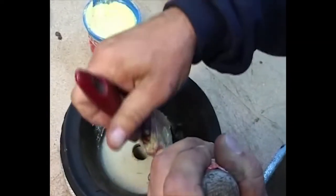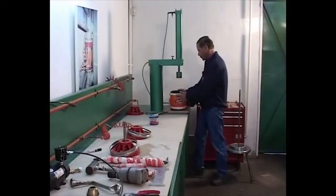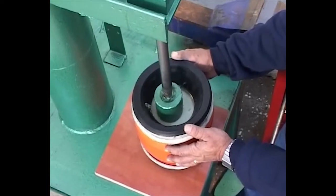There are three options for removing the sealing disc. By press machine: place the valve housing with the sealing disc under the press machine and simply force the sealing disc out of the housing.